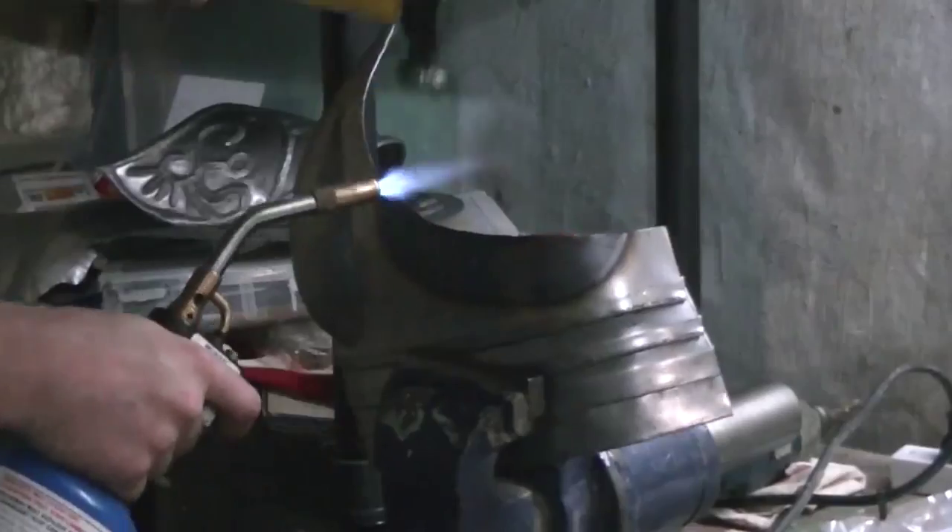There are a few components of this piece that I haven't really done in other projects. The first is folding — you can get a pretty interesting effect by folding metal back and forth, which creates a false lame effect where it looks like different layers are stacked up, without having to worry about articulation or cutting extra pieces. The advantage of the folds in this piece is they're going to provide a more comfortable surface for the skin or dress to sit against. If I'd actually made lames, there'd be a pretty good chance of pinching as she moved her ribcage around during the day.